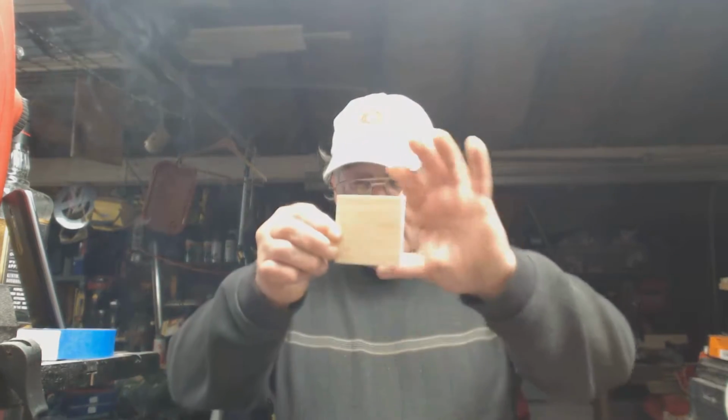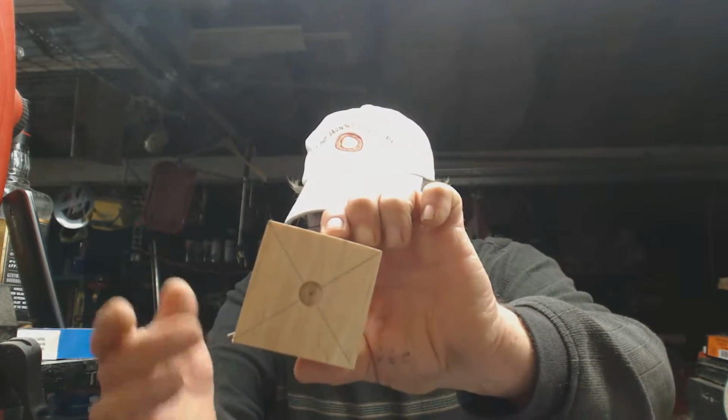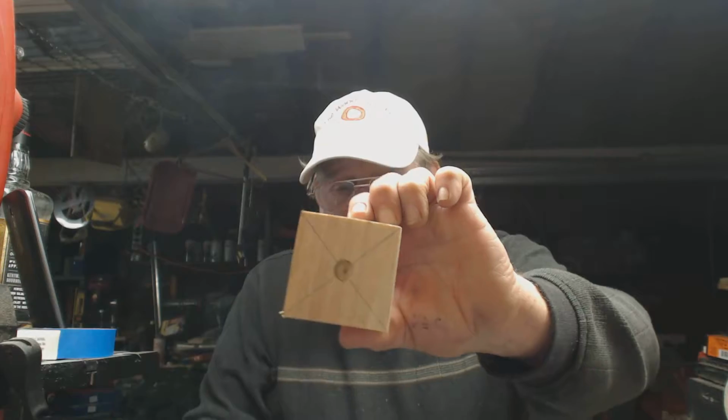And in this case, I'm using the same stock, only it's cut into, I think, 2 by 2-inch squares. Again, to find the dead center, mark the X's across, took it over to the drill press, while the drill press was still set with, like I said, I think a 3/8 bit. I don't remember exactly if it was 3/8 or one of the 32nds or 64ths, right in that neighborhood. When we do the prototype, once this prototype is done and we do the actual one, it'll be done with drawings and everything else. Well, drawings the best I do them. It'll be sketched out on a piece of graph paper with measurements and stuff like that.